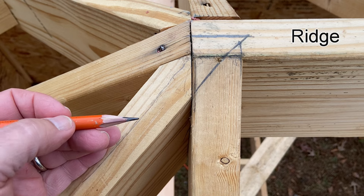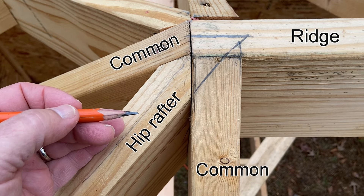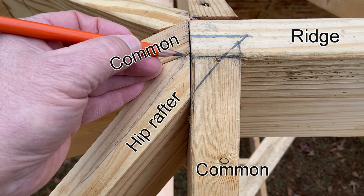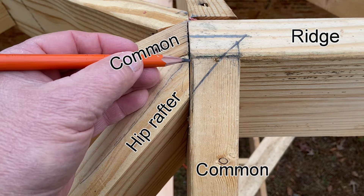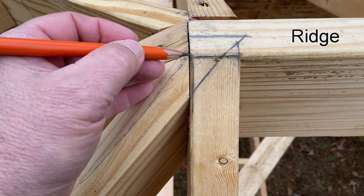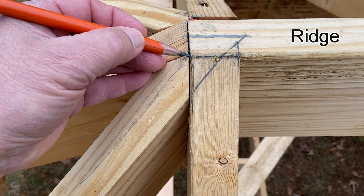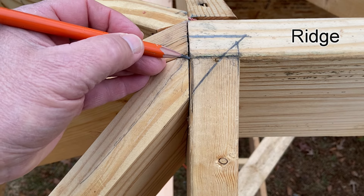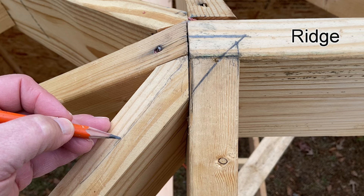The theoretical rafter length means that they're looking at it as if our roof were made up of invisible lines — an invisible line right here at the center of our hip, an invisible line right alongside the common rafter here and here. And all of these lines would converge right here at the corner of the ridge. Now, if it were that way, we could take our common length, hit our jack key, and it would give us the exact correct length for our first jack.